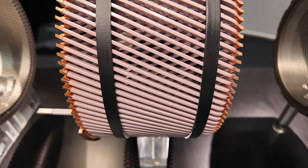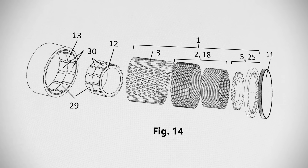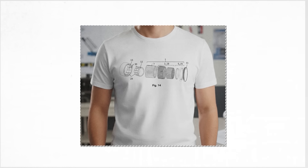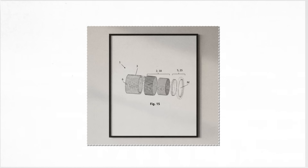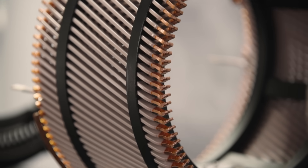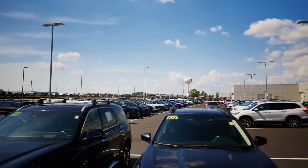The rigid copper windings solve both the heat rejection problem and the structural rigidity problem that came about from removing the yoke, which is very clever. These windings are easy to underestimate, but they are truly the key that unlocks this technology. The patent images for this also look really cool. Beyond making the motor work, an extremely important feature of these windings is that they are easy to manufacture and can therefore be used in mass-produced vehicles.